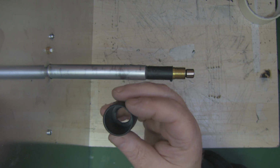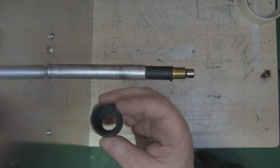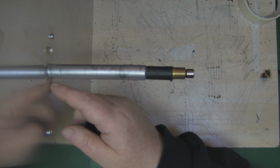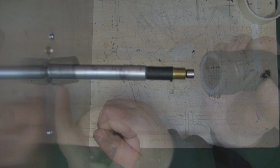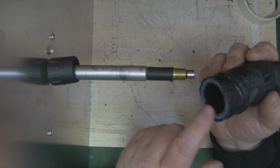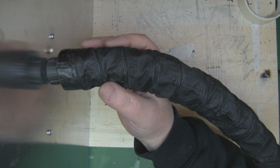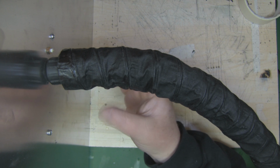Now, epoxy is a really strong glue and I use it all the time, but it does need quite a large surface area in order to be strong. If I just glued the helical using the material, for instance, to this part of the reflector, it would eventually fail in this area because it hasn't got a big surface area to make contact. So hopefully when I epoxy this in place, it's not going to move anywhere anytime soon. I can put epoxy around inside here, and feed the helical over the top of that rubber stopper. Then we've got a good surface area of grip for the helical itself. We can solder it onto that pin there, and it's not going to rip out when we extend the antenna itself.